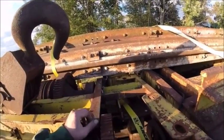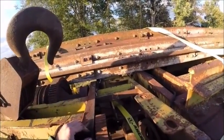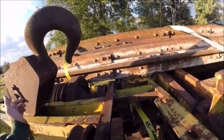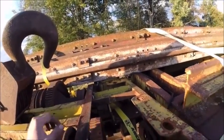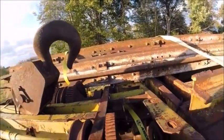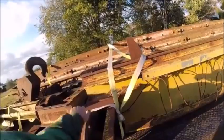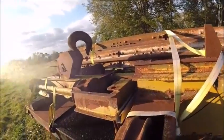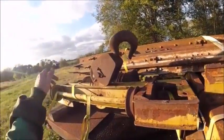I looked up, I've got a book on Wright Hoist, same kind of time period. And according to their book, on a 15-ton like this, you'd have to pull 200 feet of hand chain in order to move this hook a foot. So I can see why they put an electric motor on it. Nobody wants to pull 200 foot of chain. It only moves the load a foot. Especially not if they're not using the full 15 tons.